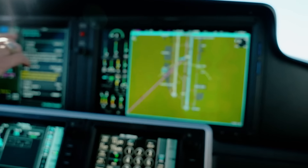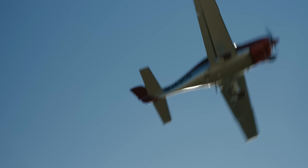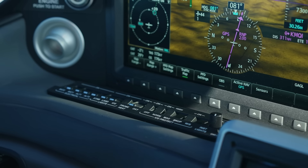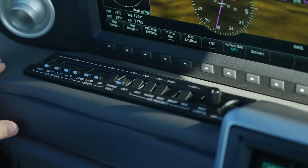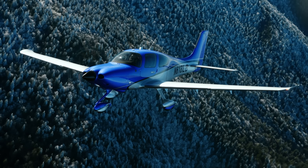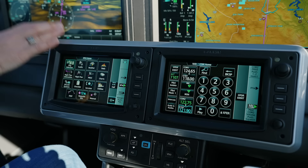There's a taxi routing feature — it's like a flight plan for the airport, and it draws the routing right on the airport diagram. When configuring for startup, the engine starts without a key: the outer knob works like the key with the mags — rotate to both and push the button. The bolster switch panel has been simplified: the avionics switch and nav switch have been removed. Checklists can be pulled up on the right side of the PFD and navigated with checklist scroll wheels.